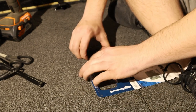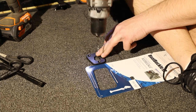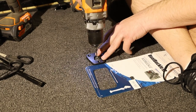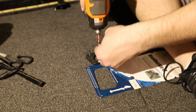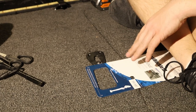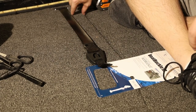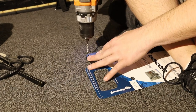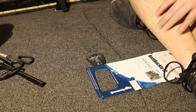If you have it off to one side you end up with a bulge on one side or the other; if you have it perfectly aligned you don't have either. Right here seems to be where it needs to go for alignment. Already have our drill ready with the one-eighth-inch hole since we're using these little bitty screws — we're not going to need a very deep hole here. Going to be lazy and use the impact. Now I just want to double-check my alignment since I only have one hole — clip it in. It looks straight and square to the rod locker. Undo it and go ahead and put down the other two holes.